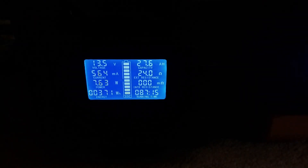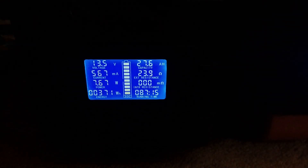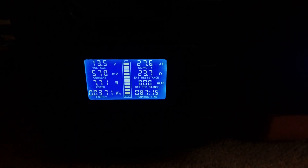What's happening right now in standby mode is that the inverter charger, which has a built-in DC charging circuit, is keeping my battery voltage held at 13.5 volts. You can see right below that it's putting 570 milliamps — about a half an amp — into the battery, which is roughly 7.67 watts. That's just keeping everything topped off and maintained, what they would call a float charge. This would be a utility-presence situation.